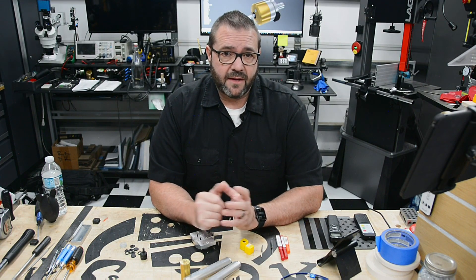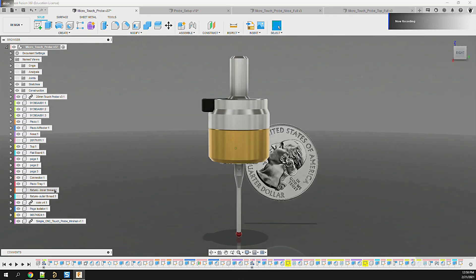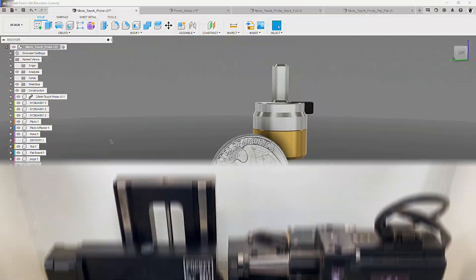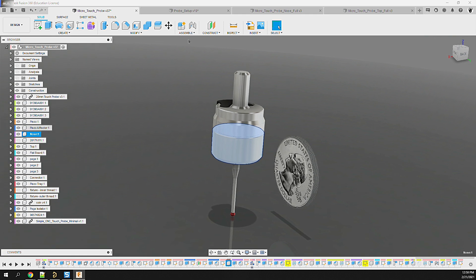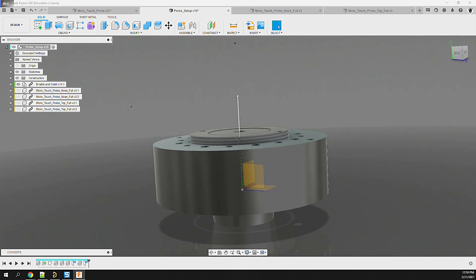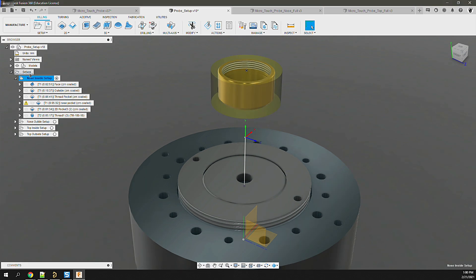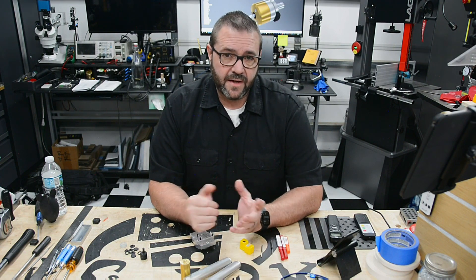With the boards being manufactured, it's back to making the rest of the parts for this probe. Now these parts are tiny and complicated, and while you could 3D print them with resin, it wouldn't provide the quality and performance I'm going for in this design. To do these justice, we'll be milling them from brass and aluminum on a PocketNC 2-10. As these are complicated parts, even for the 5-axis machine, this will require some planning. I save out the individual parts of the design, then start a new design for the part setup. In the setup design, I pull in the PocketNC B-table to hold the 25mm bar stock that I'll be milling these from. This is used to position and reference the machine zero for all the operations. If you're new to 5-axis and interested in learning more, I've put a link in the description to a video I created on just that.